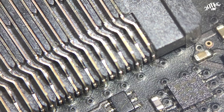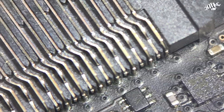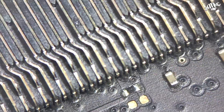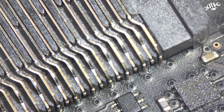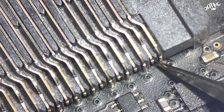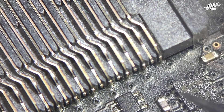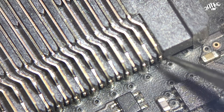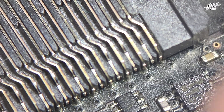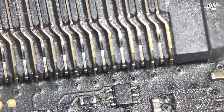It's very time-consuming but it's got to be done. Usually it's three or four pins — it's very rare that all of them pop loose. You can just touch up the solder, flow it back in place and hope it sticks, but you want the next owner to have this for as long as they can use it. So do the extra work, scrape the traces, get it done right.